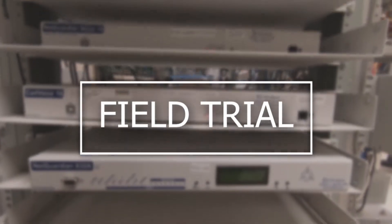That brings us to our third and final way to get an RTU eval — and this is really my favorite — the field trial. A field trial is the ultimate RTU evaluation experience. This isn't for when you just need one or two RTUs, but if you're looking at deploying 10, 20, or more remotes, you can get a manufacturer who will send a team out to work with you for a few days and really make sure it's a perfect fit. They might develop a slightly different firmware feature or make an adjustment to the way they handle a protocol. If you're looking at a substantial deployment, you should find a manufacturer who is forward-looking enough to say: yes, we'll send a team to you and help you work it out, because we want this significant project to go exactly right.